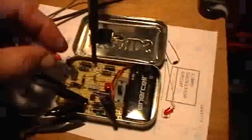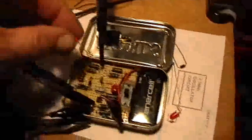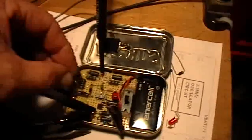Okay. So now I'm going to take the capacitor and just put it in the same place where the zener normally goes. Just like that. Now I just touched that capacitor to there, and now I've removed it again. It's not in there anymore. But look where the current is. Remember where our baseline is? Right there. So the current has gone up. This is being shown at 0.05 volts per division. So that's 50 millivolts. That's just below the 50 millivolt line. It's 40 millivolts, and it's a 1 ohm resistor. So that's 40 milliamps of current right there being shown.